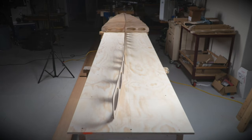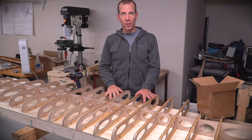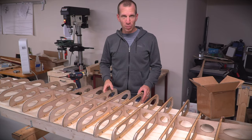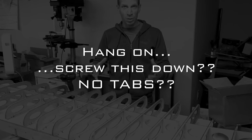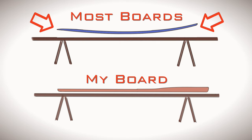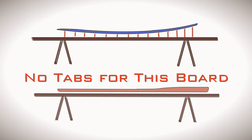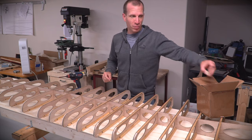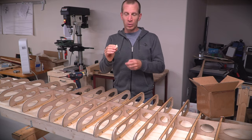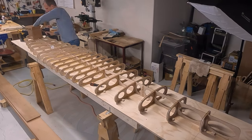Frame assembly. This part was easy — it just assembled itself. No glue required at this point. Now that I have all the frames finished and ready to go, and the guidelines drawn on my building table, the last step is going to be to screw everything down. Most of these frame kits come with some sort of removable tab to suspend the frame above the table. I'm sure that system works great for most boards, but this one happens to have no rocker for almost its entire length. I decided it would be simpler and much more rigid to attach the frame directly to the table. I made a bunch of little blocks with a 45 degree bevel on one side and a hole in the middle, and I'm just going to use that to put up against each frame. The triangle reinforcements I put on there will fit nicely into it, and I'm just going to line everything up and screw them down.